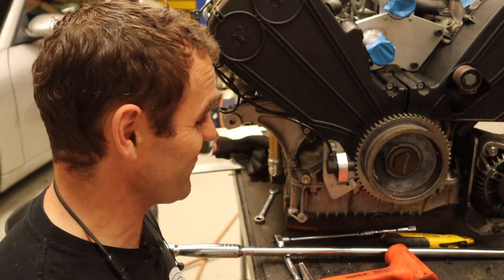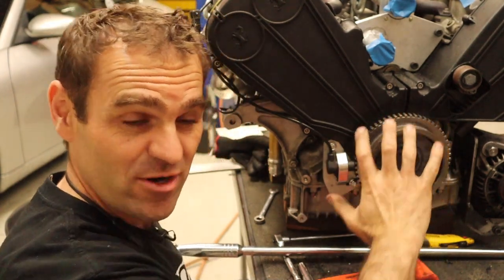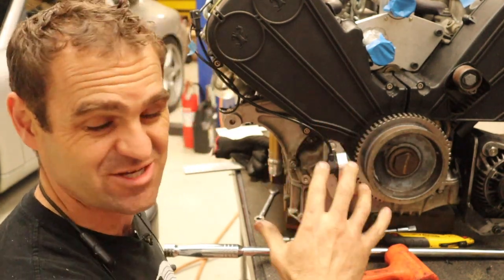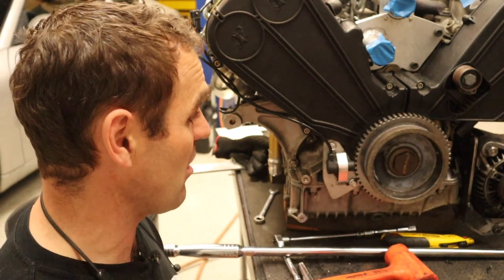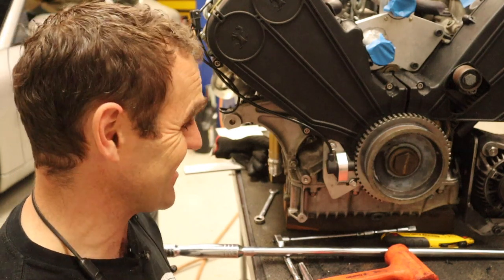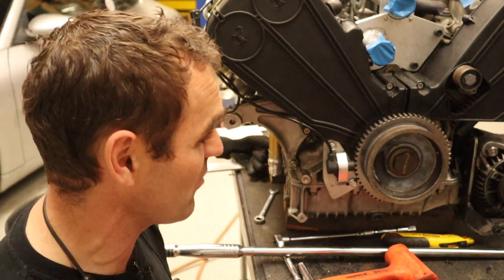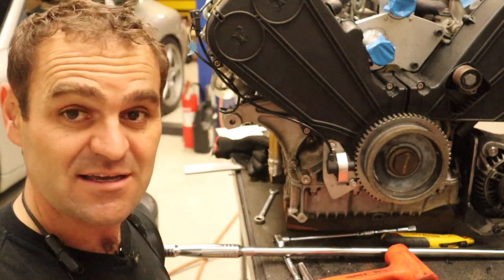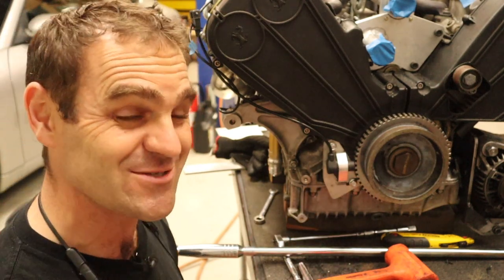Well, that was a couple of days of quite satisfying work. I've managed to mount my degree wheel and got my reluctor all set up so that I can read the crank signal from my Ferrari engine. It's getting there - that's another big worry job off my mind. I'm quite happy with how it turned out, happy with the placement of everything. It's really good but I'm definitely out of time, so I think that means it's time for fun facts with Mrs. Jeff.